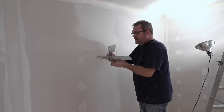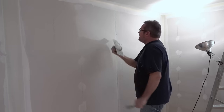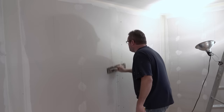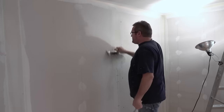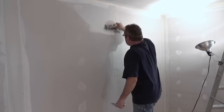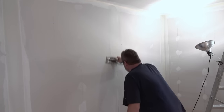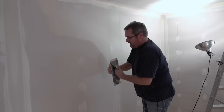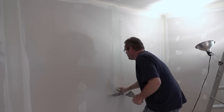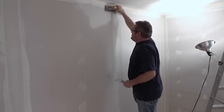On this joint I'm going to use the trowel. I'm going to put a big hunk of compound on there and trowel right into the depression, covering the tape. I'm going to get it in there and then I'm going to screed off as much as I can, but it will be very close to level with the surface of the drywall.